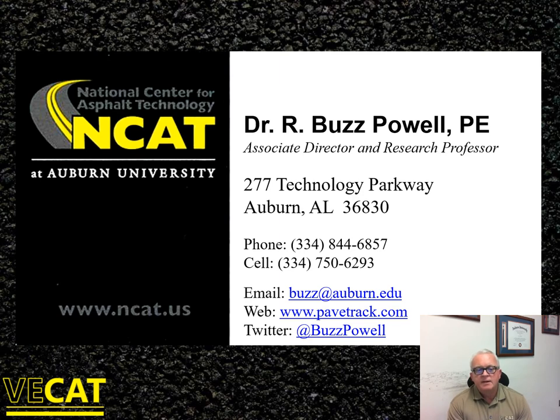The finished roadway with shoulders pulled up is very smooth — we're extremely pleased with the outcome. In the cold recycle test sections there is no cracking and no appreciable rutting; with just a one-inch overlay, performance is outstanding. There is a little reflective cracking in the FDR sections, but the story is very good for cold recycle mix. That road was torn to pieces before we installed those sections, so if you do a good job with mix production, placement, compaction, and overlay installation, you can expect your cold recycle project to turn out really well. Thank you so much for your time.